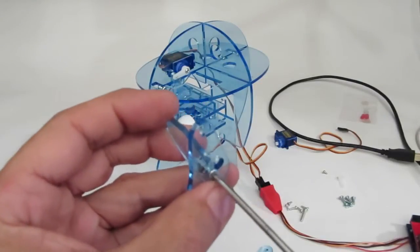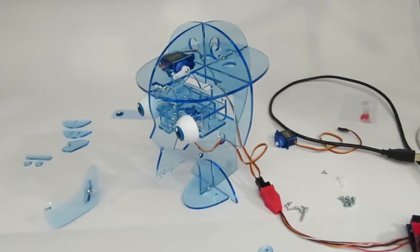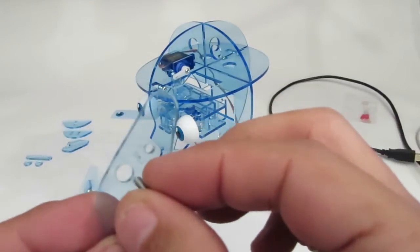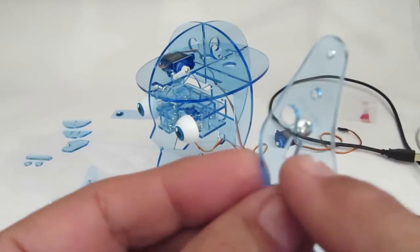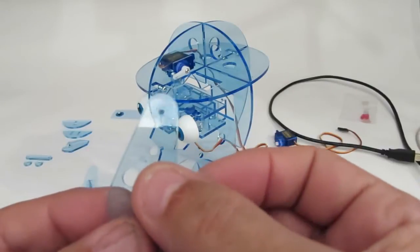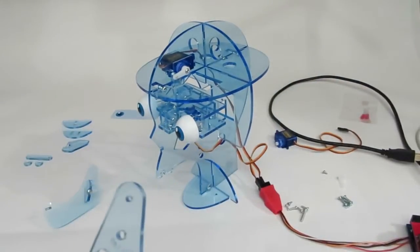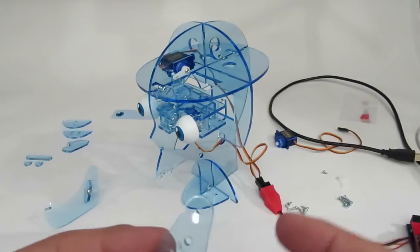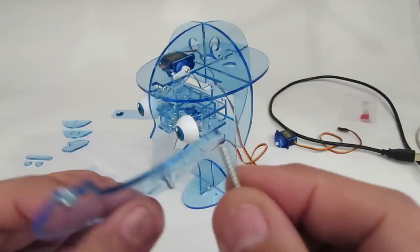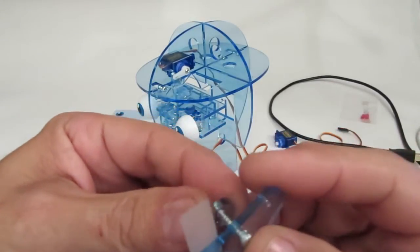Put that into place, grab a machine screw and just snug that down. There's the jaw right. Now I found a nice little way to make this next part a little easier. Here's the jaw left — flip it around. I'm going to put this screw through the hole that's just above that slot so it holds it in place a little bit. I'm going to put a piece of tape over it just to hold it in place, but not covering the slot. Now we'll be using the big plastic screw in through that hole.